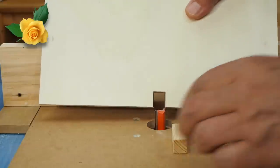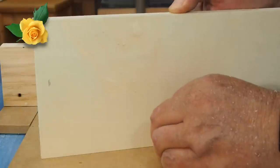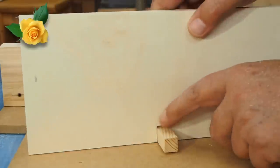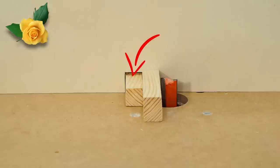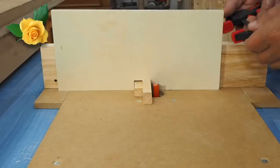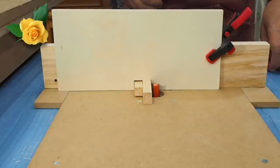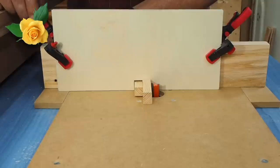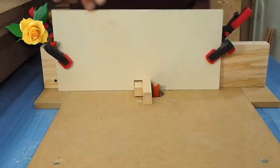We've made the guide. Now we have to put a piece that is the same width as the slot and place it there. Both the piece of material we've placed in the slot and the router bit are the same thickness, and this middle piece is the same size. We place it there because that is the distance we'll need between the router bit and the piece of material. Once we have that, we clamp it with a clamp and we're done.